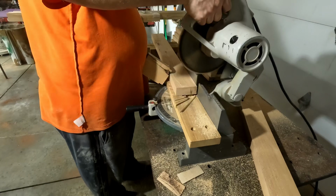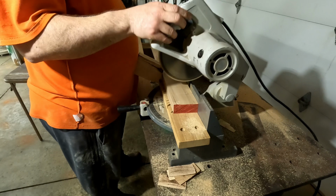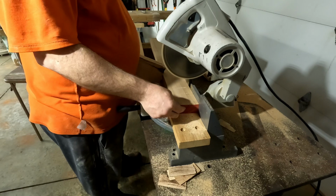Because all this wood originated as rough sawn lumber, I'm first taking a slice off each end to square it up. Then I turn it around and I cut to length. I left this one small snippet of saw cutting in to show how much I'm obsessing over each cut, as each cut counts. This will pay volumes when I go to reassemble later. I'm trying to hold a tolerance of less than an eighth of an inch, just to make everything come out looking nice in the end.